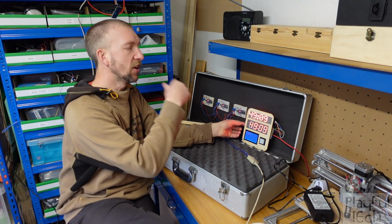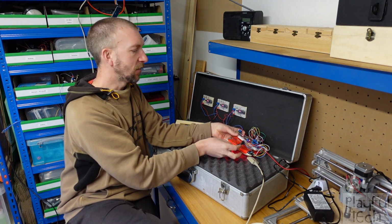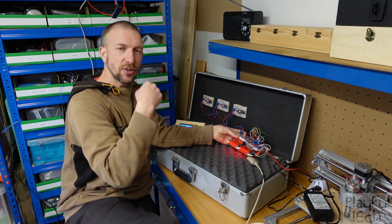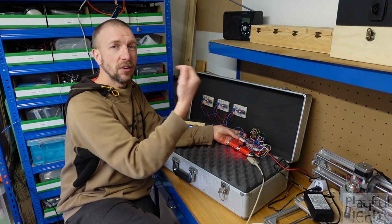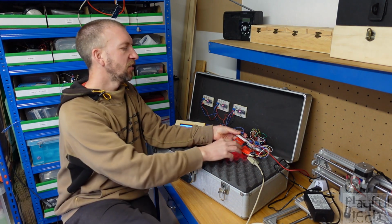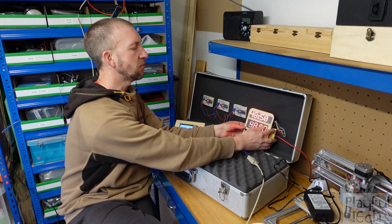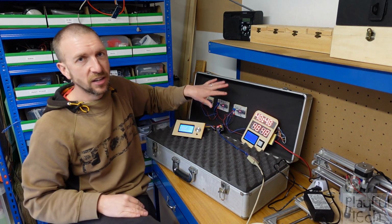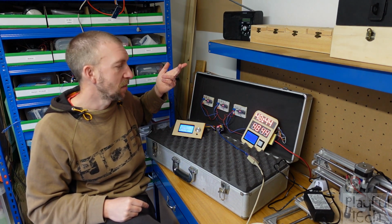You literally have a transmit and a receive line, which I've got on my ESP, and I connect the transmit of the ESP to the receive of the Arduino, and the transmit of the Arduino to the receive of the ESP, and it's like a direct connection between the two. So that's why I can't use a serial interface to connect from the ESP to all of the devices. It can only go between two devices. So that was the first question about that.